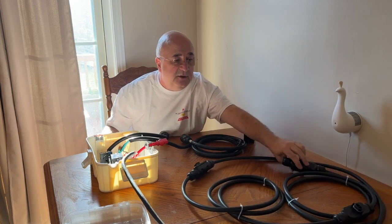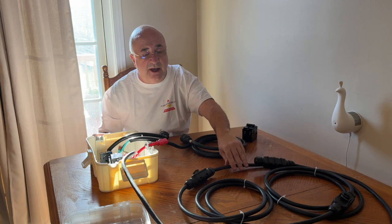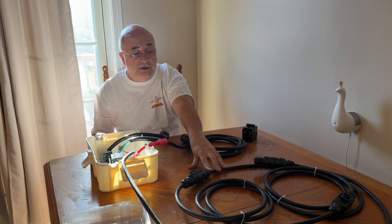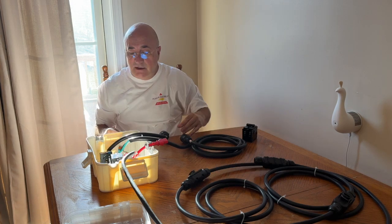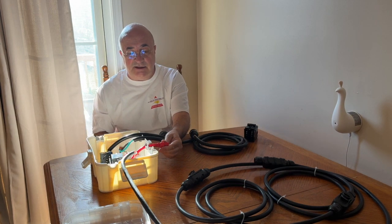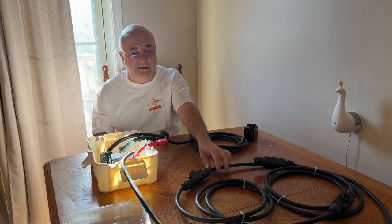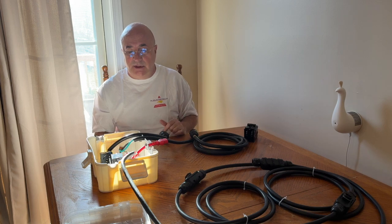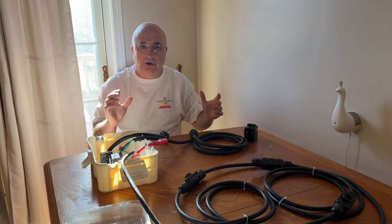There are three trunk connectors, and for HMS 2000 that's the most you can have. For HMS 1600 you can have four. But we want to stay just under 24 amps. Three HMS 2000s will give you 24 amps at the peak of the day. That's the gist of it. This little wire here is just the same 10 amp circuit I had before, so I can hook what I've already made to this rather than run this 60 feet out to my solar panels. This is for your information and education.